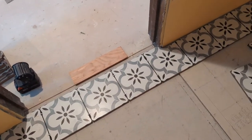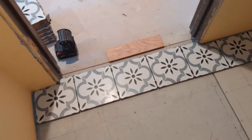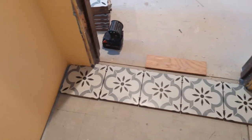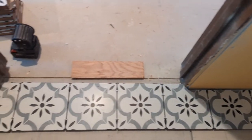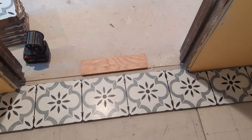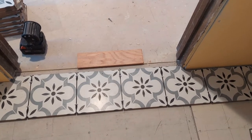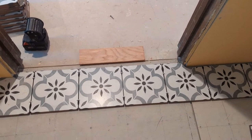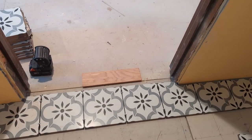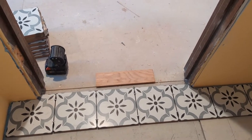For that reason, you want to lay out the tile before you ever begin. I'm going to cut these against the wall because I want the full tile in the doorway. This one in the corner is cut, and all along this edge the tiles are cut about an inch so that I have an inch of overhang at the door. I've also checked that the flooring going down over there — that piece of wood — is going to be about the same height. If it's close, as you're putting down the tile you can make sure it becomes flush there.